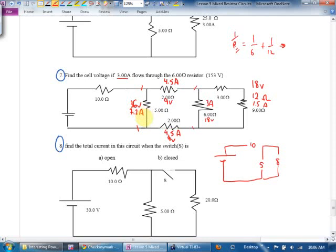7.2. Ooh, which, look, 7.2 amps going this way and 4.5 amps going this way. What's the current when they all join together? 11.6. So I think there's 11.6 amps flowing through this overall circuit. Oh, now I know the voltage drop here too. If you go I times R, 11.7 amps, not 11.6. That makes more sense to me. I'm getting a 2 and a 7. I'm getting a 2 and a 5, 7. 11.7. Or you could just talk louder. Anyways, that's okay. Sally, in a nice loud voice, what's the voltage drop through here?